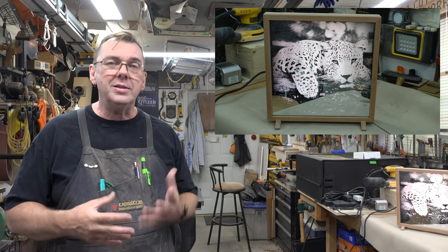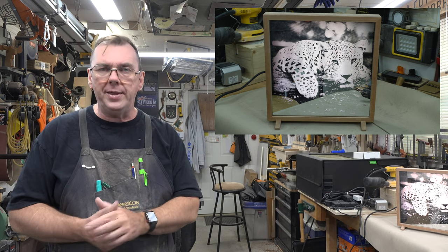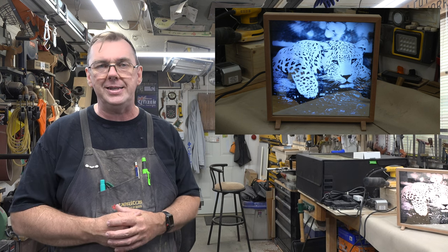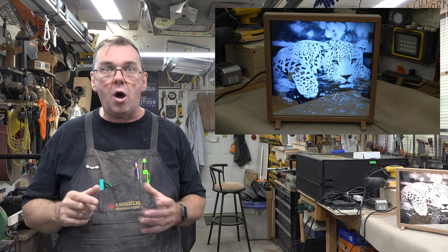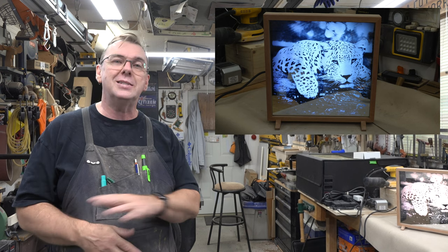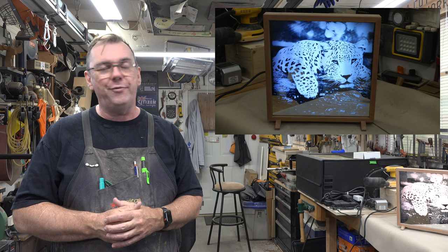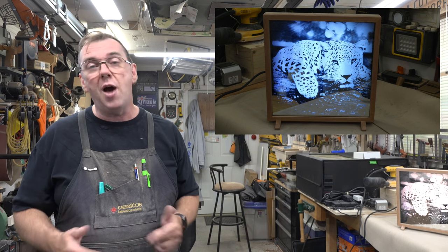Whether you try the engraving or just the skill building of making the box frame or illuminated box frame, you never know what you might come up with. One thing I want to mention for full transparency: after the plexi was glued in, I wasn't happy with the diffusion — you could see individual LED dots through the mirror. Simple solution: I cut a second piece of plexiglass, sanded both sides, and used a dab of hot glue in each corner to hold it tight against the original. It diffused perfectly and evened out the light.